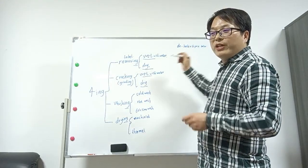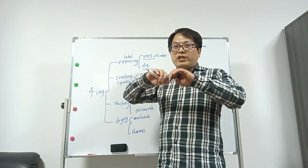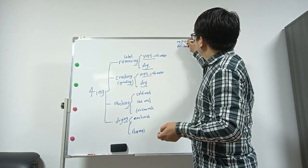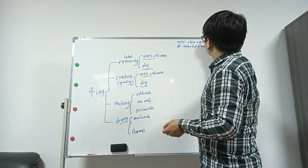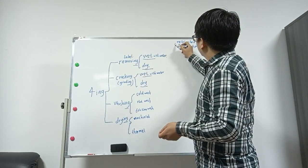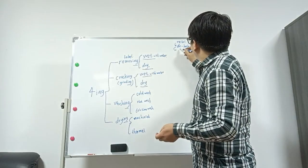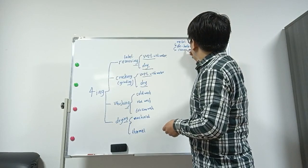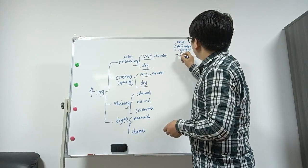But before the open baler, we see they have big cube PET bottles. We need to open them individually. Feeding them is not easy, so we need the metal chain conveyor. Then go to the debaler. Debaler to the trommel through the belt conveyor, of course, because they need to be connected by the conveyor. Then to the trommel.